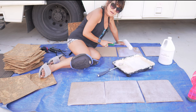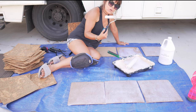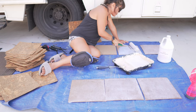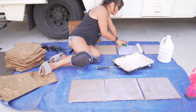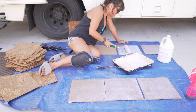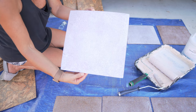Oh, hi, you're there! I decided to switch from the tile roller to the floor roller because it goes faster, and you have to make sure that the entire tile has glue all over, especially on the edges — completely glued on all corners, everywhere.